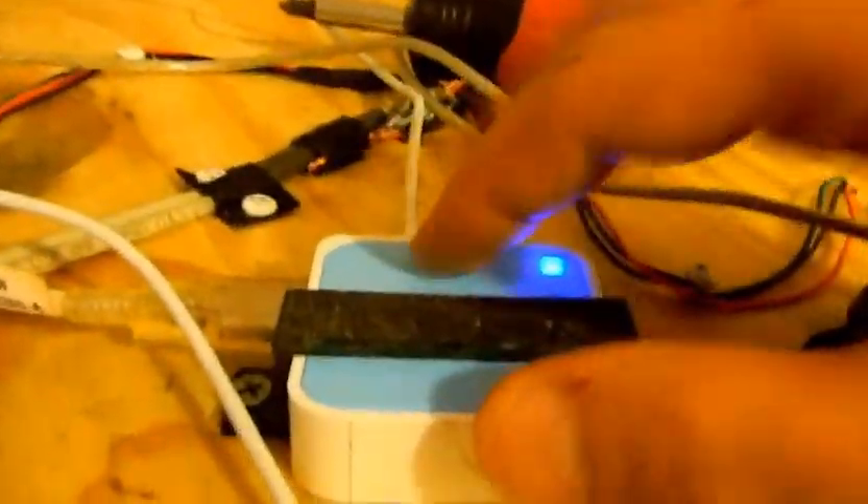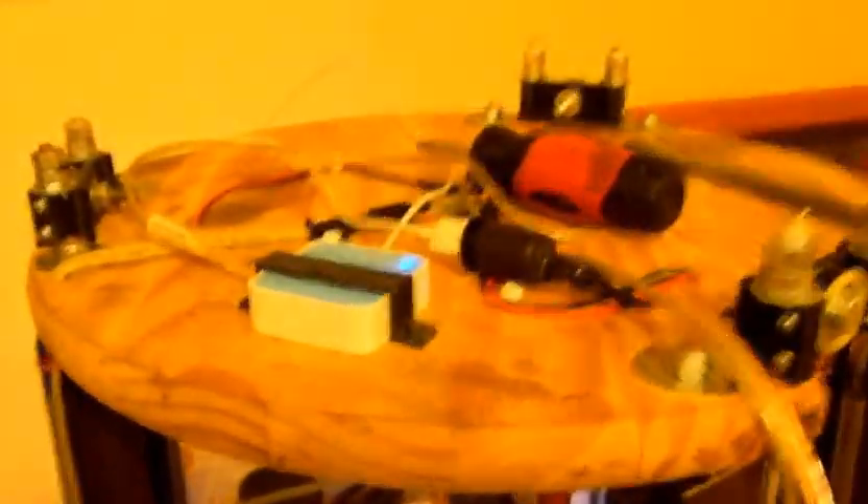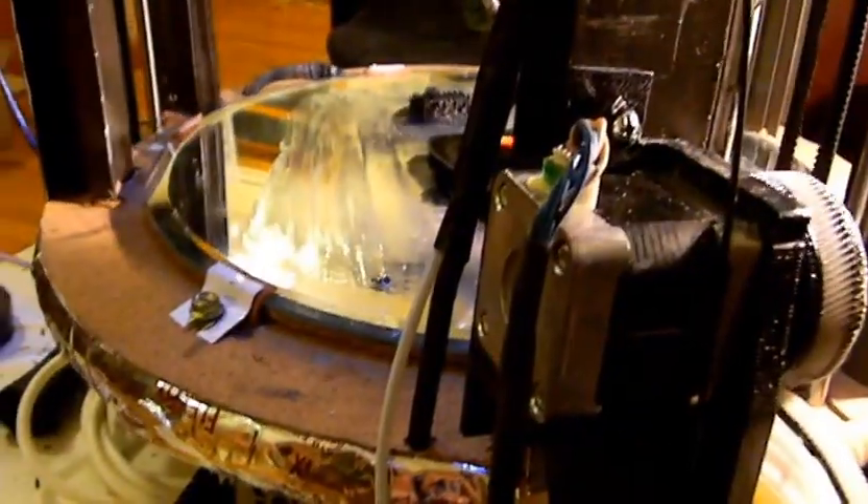I'm working on that - one of the things I want to do is put a heated chamber in this thing. Also I made a little bracket for this TP-Link router, about $17 shipped, and a $5 USB adapter from eBay, hooked up to a 12-volt power supply. This thing is running DD-WRT now, no longer the TP-Link firmware. What it allows me to do is run USB over IP - therefore this printer is essentially wireless.